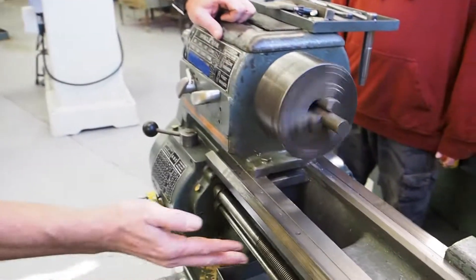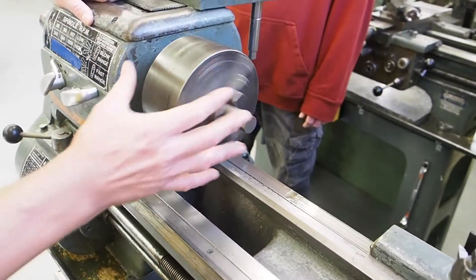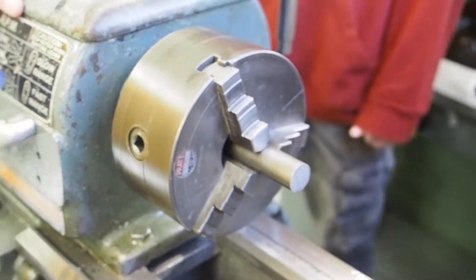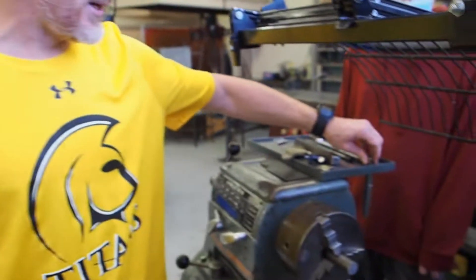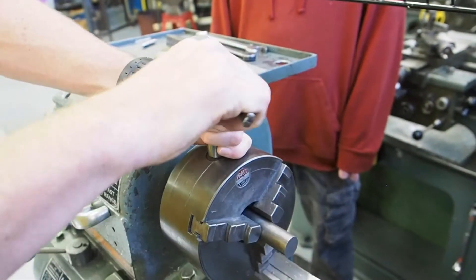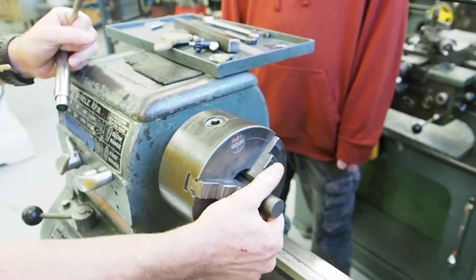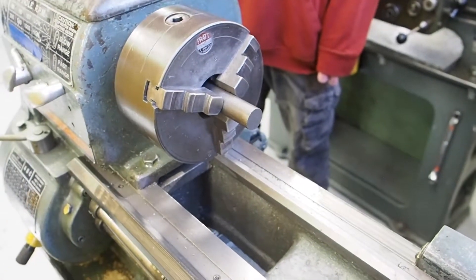For the most part, though, these bars won't be spinning because you won't be using the automatic feed — it's just this. Keep your hands clear of that part right there. Rule number three: be sure your workpiece is clamped securely. We've got to make sure our workpiece is clamped securely. Here's our chuck key — I like to bring the chuck key with leverage all the way up to the side and really crank down on it to make sure it's tight. Then we're going to do our budge test. It's not moving — we're good to go.